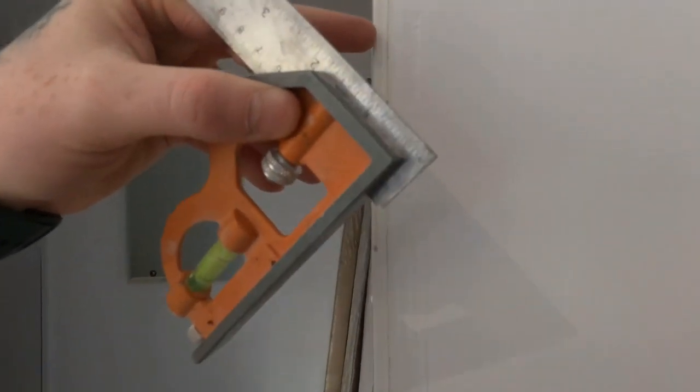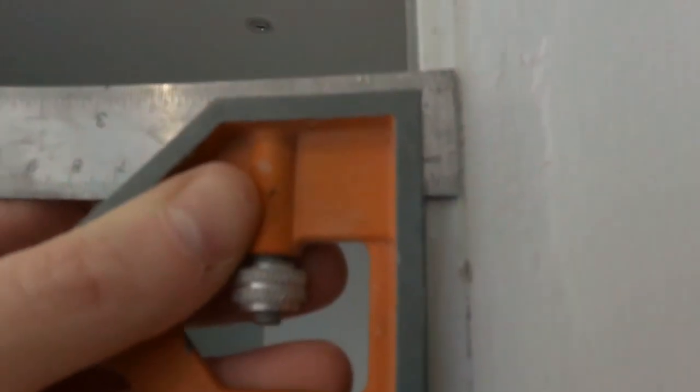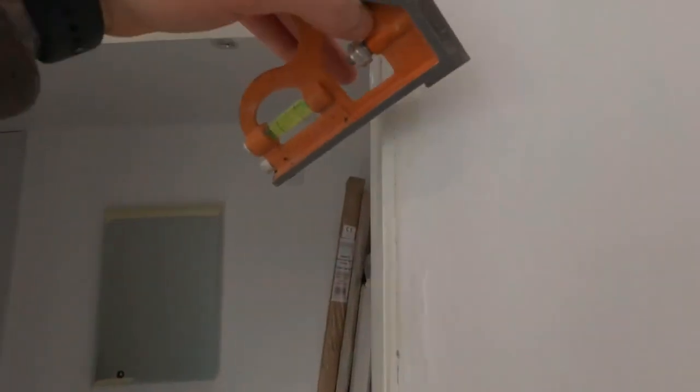Combination square. See my mark going up the wall? Unfortunately the client's painted already so it's a bit more of a pain, but let's go about 7mm. So you set the combination square to 7mm and run that down with your pencil butted up to there. It's a bit tricky. And then you can see the very angle that you need to take your measurements - measure from the floor up to that point, which for us is 2m.